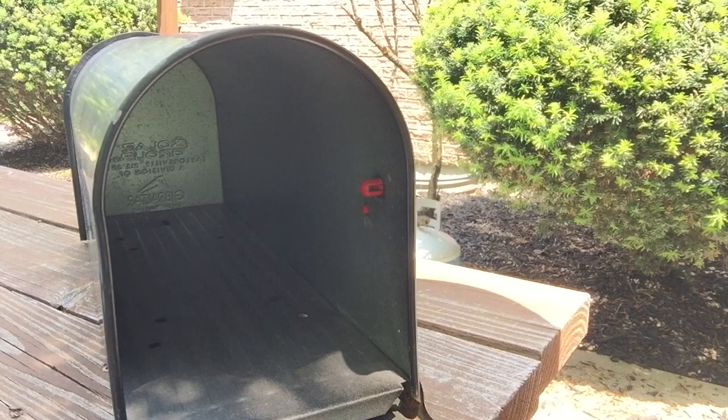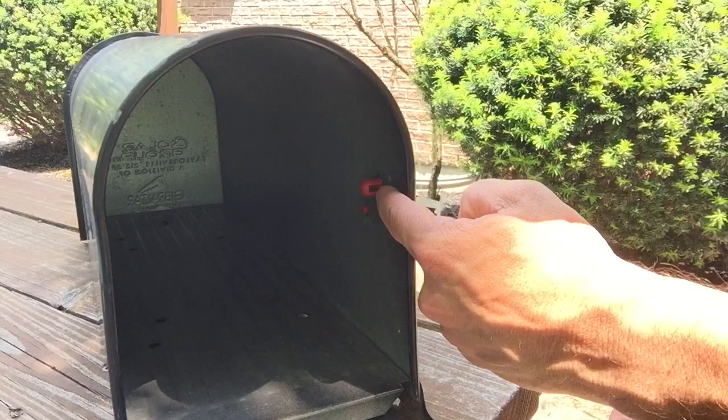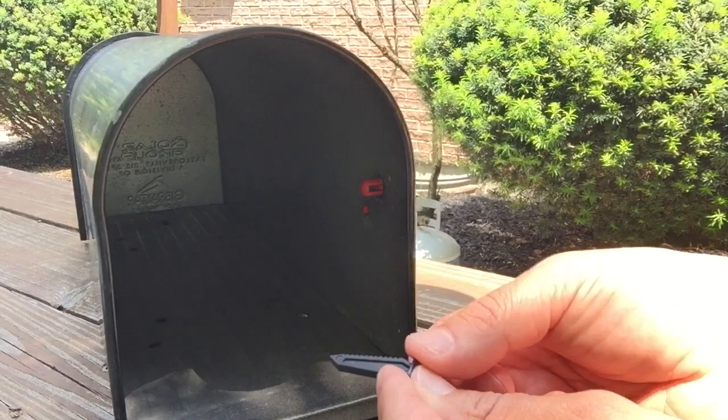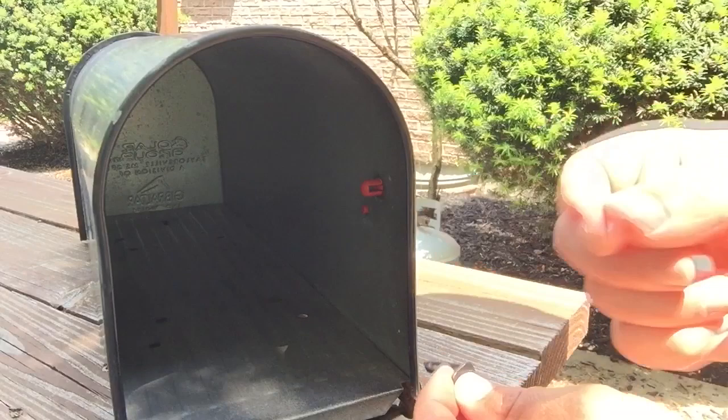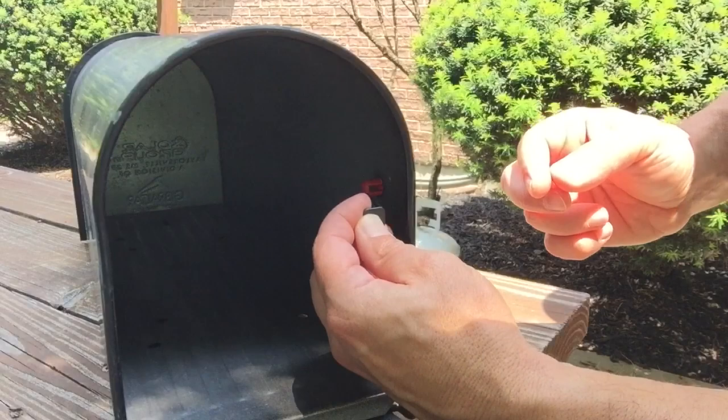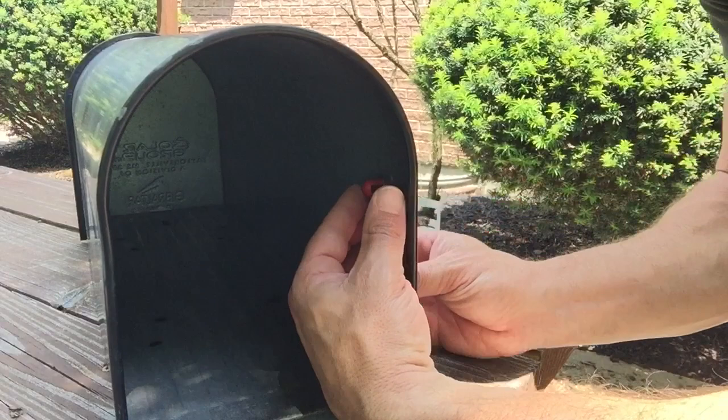Now to finish the job — I repositioned the camera so you can see inside the mailbox. This is the piece of the hub that's sticking through that big hole. Grab that alligator clip and turn it so that the sharper edges are facing towards the flag that you just installed. Push it right into the hole in the hub. So again, grab your alligator clip, edges facing towards the side of the mailbox where you put the flag in, and just press it in all the way like that — and you should be good to go.